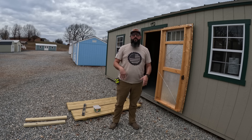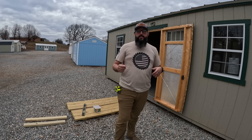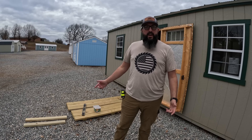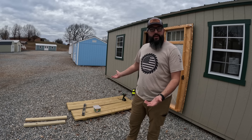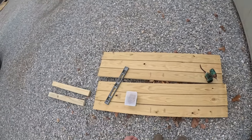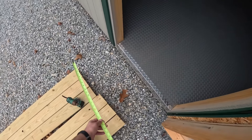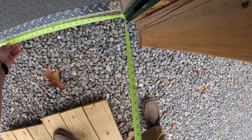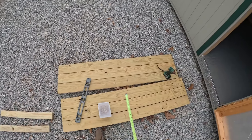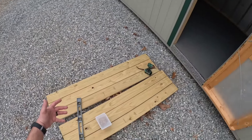So I have the shed that we're going to be putting these ramps onto. This is a 12 by 24 shed. We're putting the ramps on this door that has a 36-inch opening. I'm going to switch to the GoPro head mount so you can see me installing the ramps. You really want a two-foot level on smaller doors — a four-foot level won't fit in the doorway. I got my two ramps laid out, my ledger board, my backstrap board, two-foot level, screws, and my impact. I'm taking a measurement — it's 35 and a half inches, but I want 35 and a quarter to give myself a little wiggle room, so I cut the 2x4 down to 35 and a quarter.